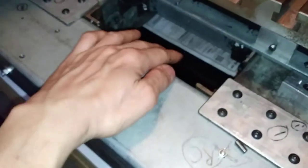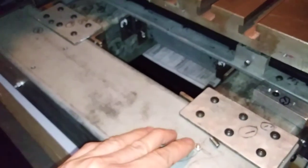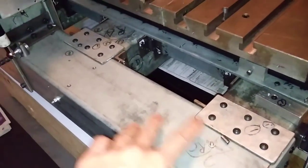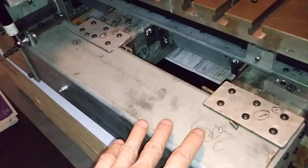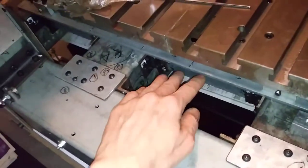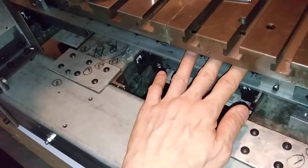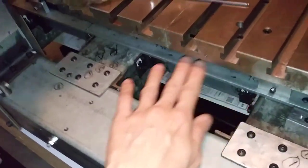I use this micrometer and the stand, put it on this granite surface, and then set this screw top surface so that four of them are in the same level, on the same plane, and on the same plane that is parallel with this reference surface. As well, it will parallel with the planes of the four moving blocks.